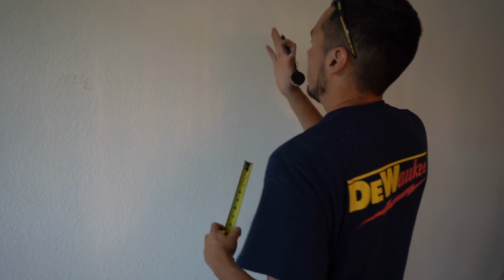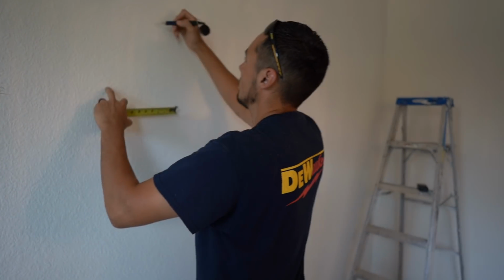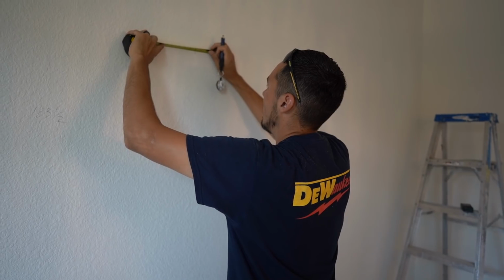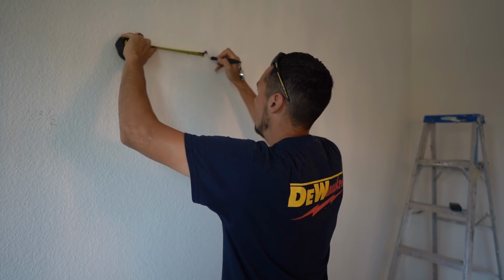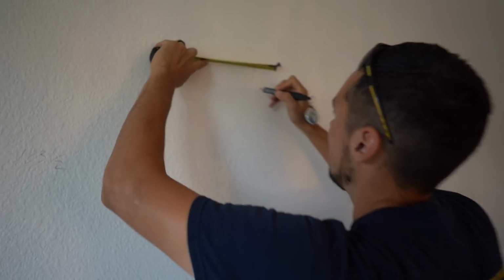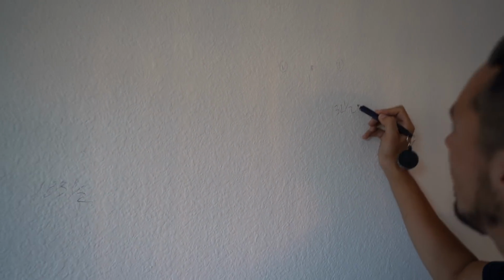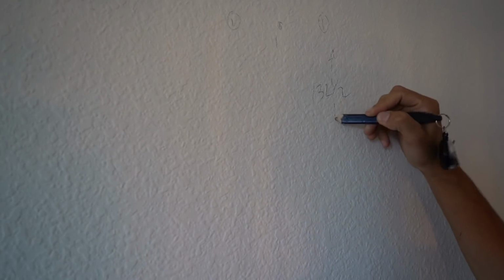So we've got the center of this wall found. It's this circled line right here. And since we're gonna be putting a 1x6 down the middle, we'll split on 2¾. So then we'll shoot the laser on this line and this line. We'll snap a line there so we know where that's gonna be. And then we got 132.5 for our vertical measurement of the entire room.